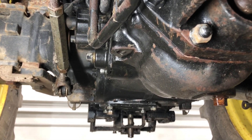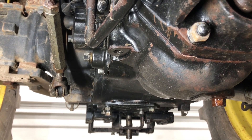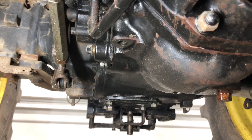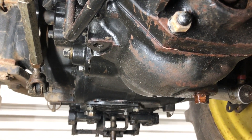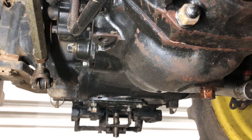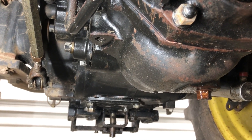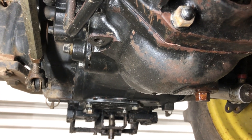When you pull that screen out, it's probably going to be dirty — don't expect it to be clean like I showed you earlier. You'll want to wash it with a soft brush, hot water, and dish soap. Put everything back together and you'll put about five gallons, give or take a gallon, back in. Then check the dipstick in the back and bring the oil level up to about the middle of the dipstick.